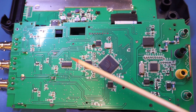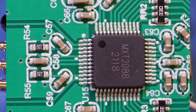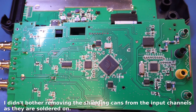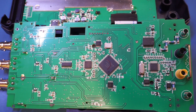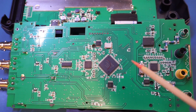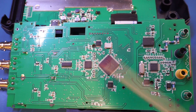On the side of the board we have a 4052 mux, and what appears to be an MXT2088 — essentially a dual-channel 100 mega-samples-per-second ADC. This matches the spec of the 200 mega-samples-per-second maximum sampling rate of the scope. This is the same ADC used in the O1 oscilloscope teardown we did before. In that handheld, the sampling rate is specced at 250 mega-samples-per-second, which is out of spec for this 100 MSPS ADC — they probably overclocked it there, but here they didn't.